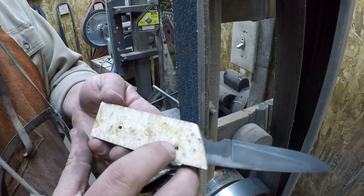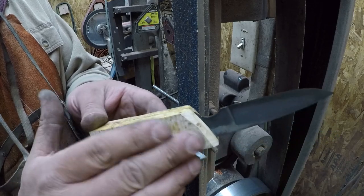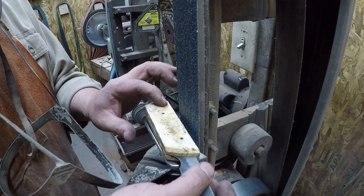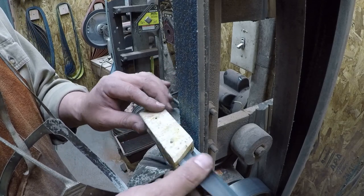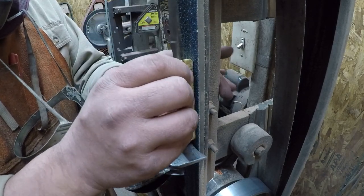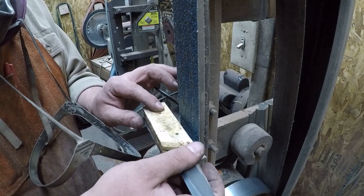What that's gonna do is, see, there's always gonna be a little bit of epoxy run out, okay? So there's gonna be run out, there's gonna be goobers, all kind of that stuff. So when you set that on your platen, it's not gonna sit flush, okay? And our first step after, or our second step, I guess, so we're gonna grind it flush like this so that it'll sit on the platen nice and flat and stable, right?